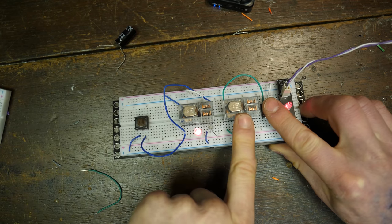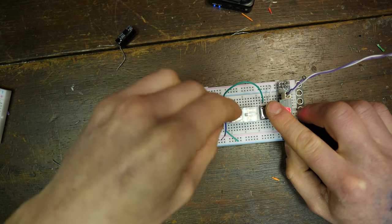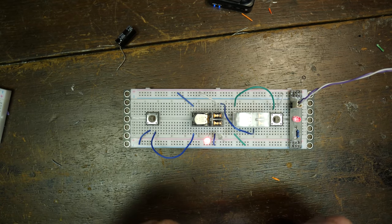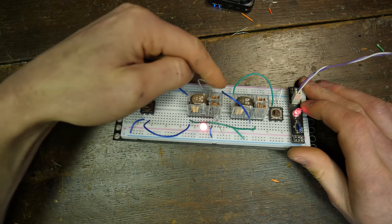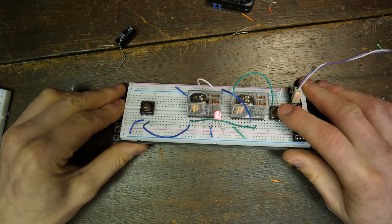And if we add another relay here to actually break the ground from this, so we'll put this one over to the switch here, to the normally closed, and then we'll wire this one into here. So the ground actually goes through this relay and into here. So now we have a set and we can reset that.